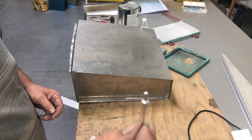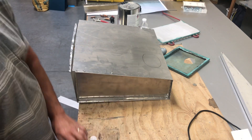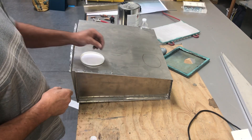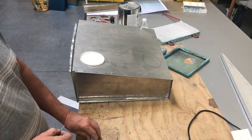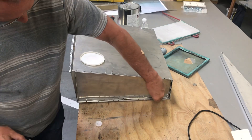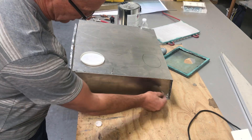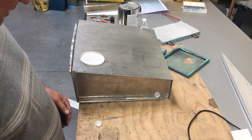What this is — it's got a closed head on it. So even if we have, let's say, our fuel filler, that would go right there. We'd use the product called ProSeal, found at Aircraft Spruce, and use these rivets to attach that. And then for fuel pickups, symbolized by the caps here, we could do the exact same thing — drilling the holes in there, ProSeal it, then using these closed-headed rivets to make the whole thing work.